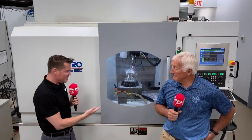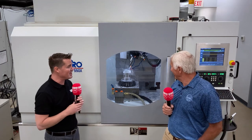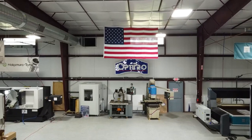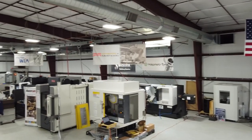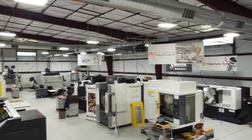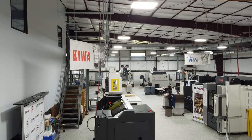Well Mike, these are the new machines — they look good. This is our latest and greatest creation that we've developed here at OptiPro. It's our OptiSonic 550X machine. This is an ultrasonic machining center mainly for brittle materials — ceramics, optical glasses — for precision machining of components being used in the medical, military, cinematography, and space exploration fields.